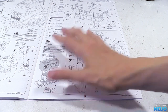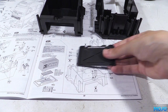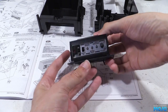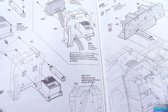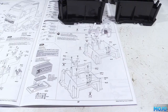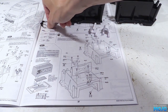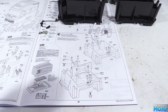Step 79: the front storage boxes. This time we need two JJ1s (the boxes), a KK2 which is the MFC control box shelf — I don't think we're going to be fitting that just yet. If we skip ahead you can see we're going to need to run the wires up through the box and behind the shelf before we fit the actual control box, so we're going to wait. We still need the boxes though, and two HH10 hinges. For screws we have four M3x6s with low profile heads, two 3x8 self-tappers, four 2x6 self-tappers, four large M3 washers, four 2mm washers and two magnets.